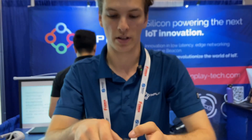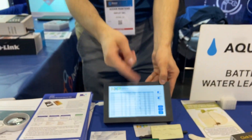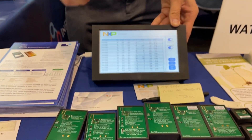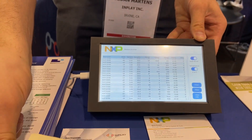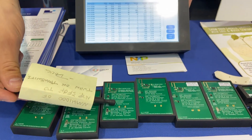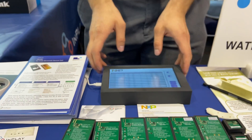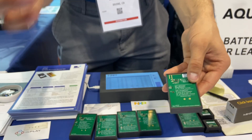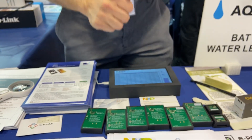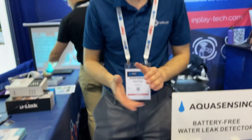This one is a battery-powered design, so if I can pop it open — very cool for the NXP demo, we have the information being live reported from these beacons coming out onto the screen here. If I take one of them and wave the magnet over top of the magnetometer, you can see some of the data start to change. Another one is triggered by the accelerometer. So to elaborate: that's the magnetometer, accelerometer, and pressure-temperature sensor — three in one, showing off a lot of flexibility with NXP.